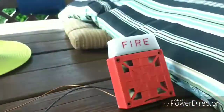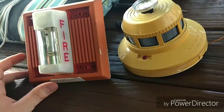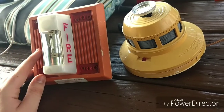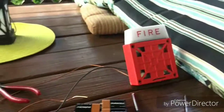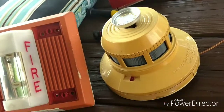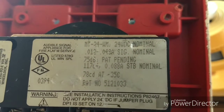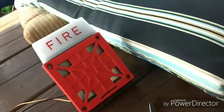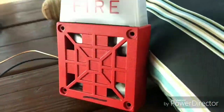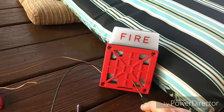One more side note: if you own an MT and are attempting to wire it to a detector using batteries, I would not recommend using the MT. I would recommend using another device in your collection that takes the same voltage. Pretty much all of these devices run off of 24 volts DC. If you look at the model numbers you'll be able to tell — with Wheelock devices, if it has the number 24 in it, that means it is a 24-volt DC device. The full model number of the 7000 2T is Wheelock 7000 2T-24. If you were to find a Wheelock 7000 2T-12, that would mean it is the 12-volt DC counterpart.